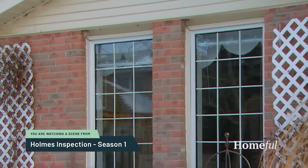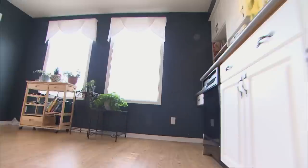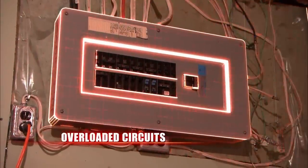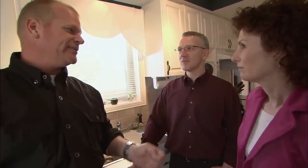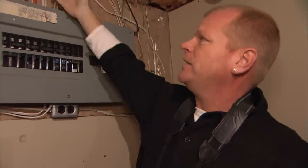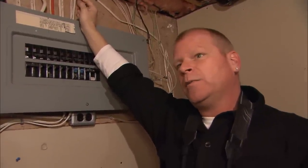Not only is the house cold, but you have electrical problems too, and you start not feeling safe in your own house. What's wrong with the electrical? We've identified a circuit that's got about 19 devices on it — way too many things on one circuit. It was not in the report. We did have permits for the kitchen, but we didn't check to see if there was an electrical permit. I will bring an electrician and check to see if there was an electrical permit. They always leave two spare breakers in the panel, but this one is obviously full. We have what looks like a 30-amp line that somebody cut off — we don't know where it leads.